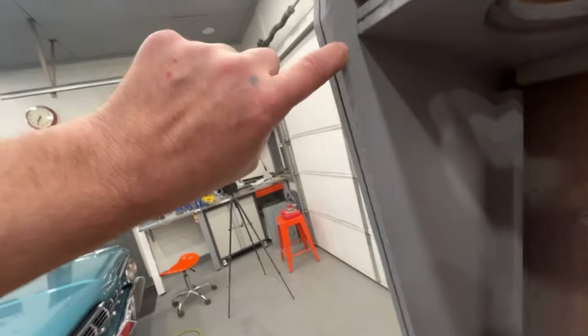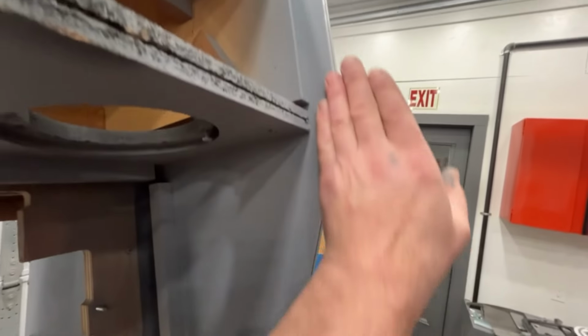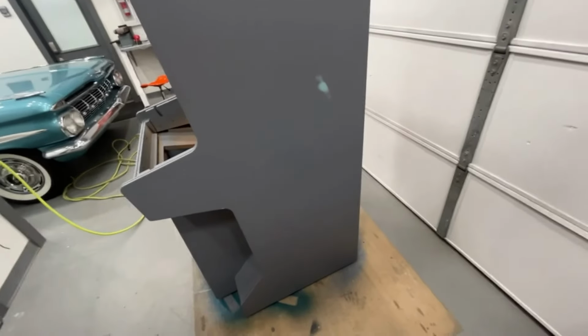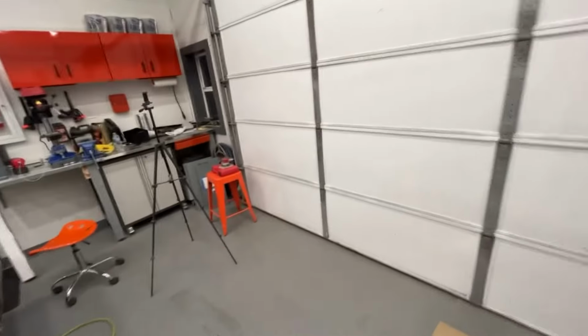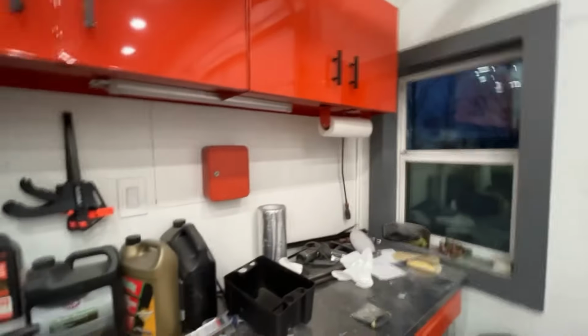I have not sanded the cabinet yet. And then I was looking in here, and if you look, this whole edge looks like crap. It's just all rough. I missed it, never did it. This side's not as bad. But what I'm gonna do is, let's mix up a little bit of that Dolphin Glaze again, and let's hit those spots. I found two spots on this side too. So let's hit these inside spots so that while those are drying, I could be sanding the outsides of the cabinet. So we're just gonna get our mixing board out here and get a little bit mixed up.